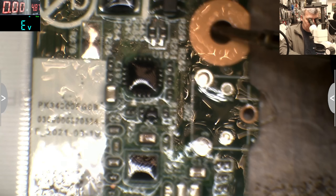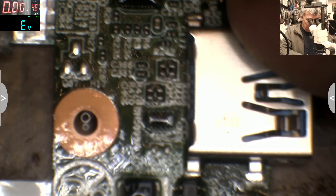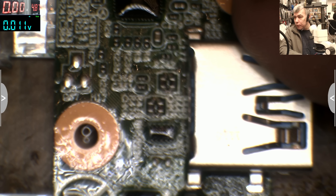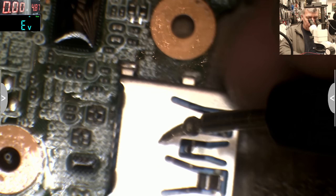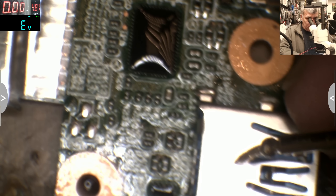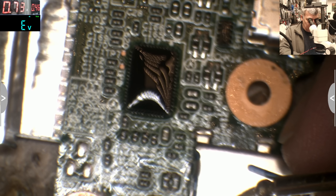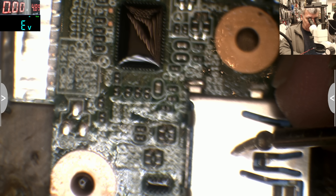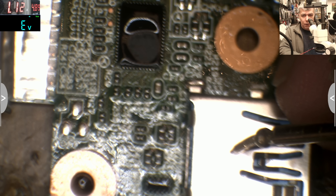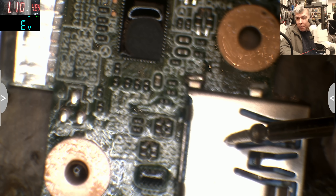I have the picture. Going with plus — I know this power is really shorted — plus here, nothing happened on this one. Let me grab the power supply. So that chip — on, off, on, off — that chip is shorted. It's getting mad hot and it's taking 1.1 amps, as you can see on the screen.